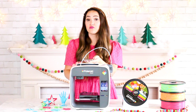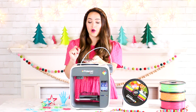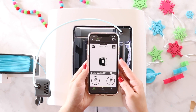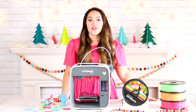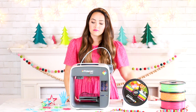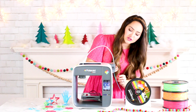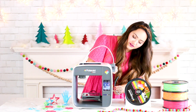To unload the filament from your machine, pull up your PlaySmart app on your phone and in the bottom right-hand corner select filament and select unload. The nozzle is heating up right now and it's going to loosen up the filament so that I can pull it out. Now that the nozzle has heated up it released the filament — I'm just going to squeeze these two levers and pull my filament out.